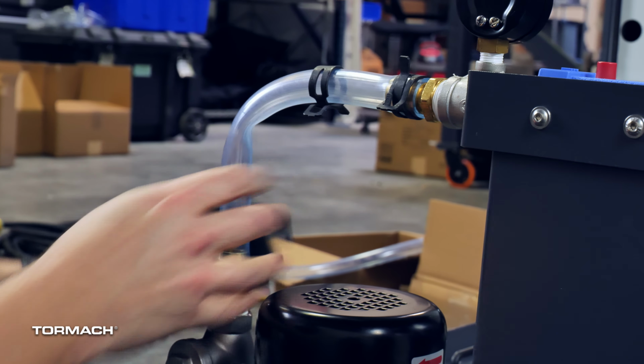Install the Y-axis washdown. Behind the table, remove the screws securing the cover plate off of the Y-axis rear way cover with a 2.5mm hex wrench. Throw out the cover plate and screws. Find the Y-axis washdown block.